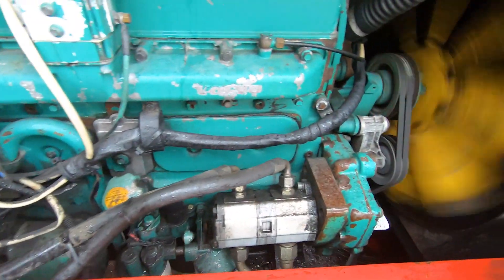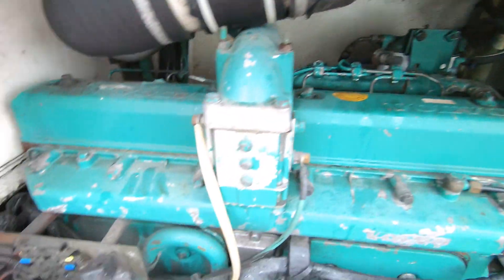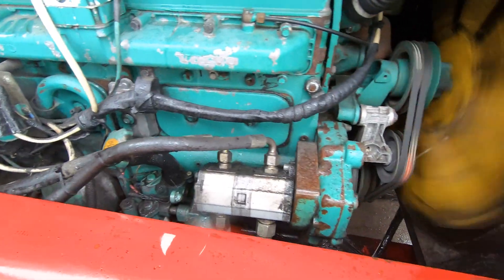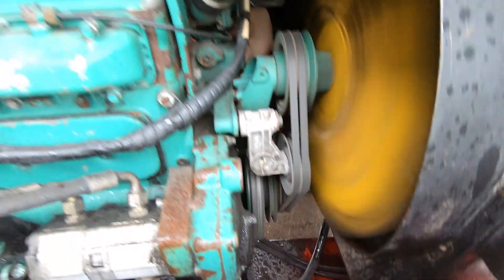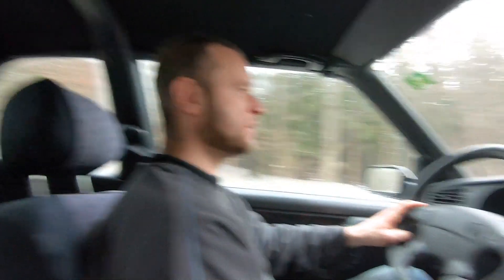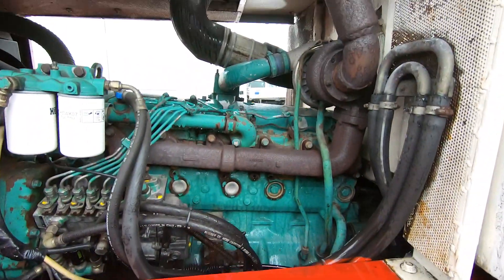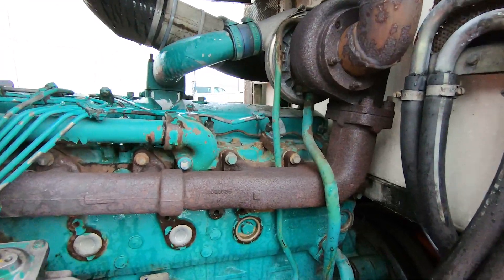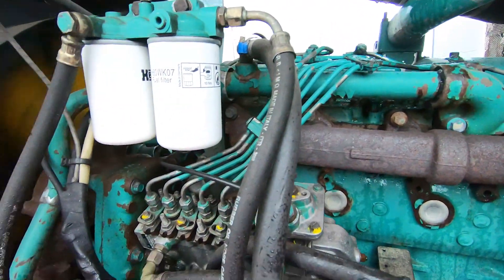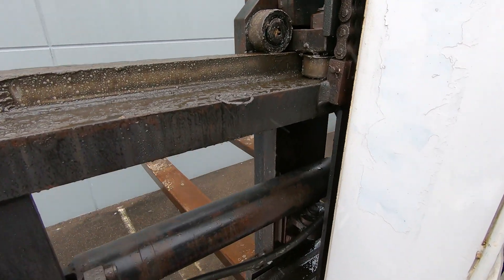I always ask for the motor to be cold — not started at all. First thing I do is check the motor, see if it's nice and cold. How does it start? Does the preheater work? Is it firing evenly on all cylinders? Is there a specific kind of smoke coming out? Does it run with smoke that disappears after a while? Is the turbocharger functioning? Then you just start going around the machine looking at general things — like the hydraulics. Are the hydraulics working? Are there leaks? Can you take the forks from the bottom to the top position, check if it moves, check if it drives, and lift something to see whether it functions under load.